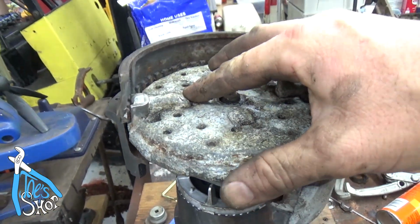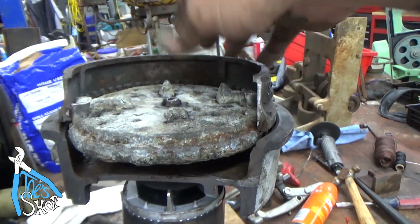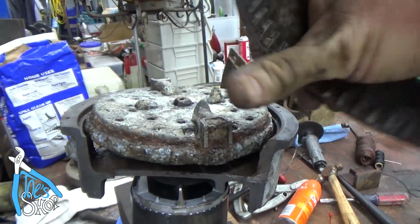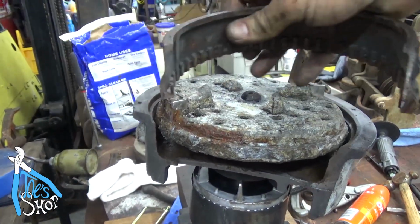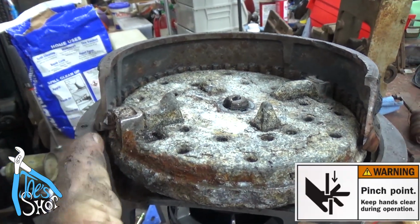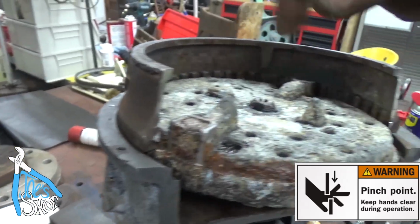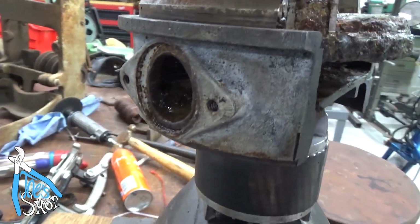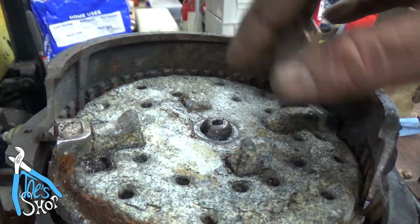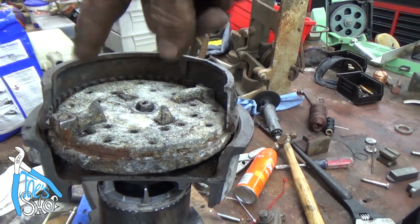And that stands to reason, because we can see here, now that we have this cut in half, that this upward section is what rotates on the motor, as you can see there. So this rotates, and as these anvils swing around, it creates this impingement point, and it sort of chews the food, as it were, and chews the food through this section, and any small bits are then shot out this side. I do not know how worn out this is, if there could be pieces missing. I am familiar with my disposal, which has little anvils that twirl around.